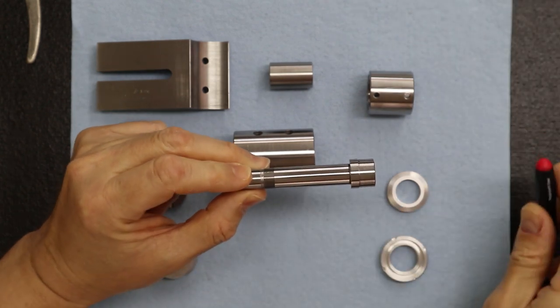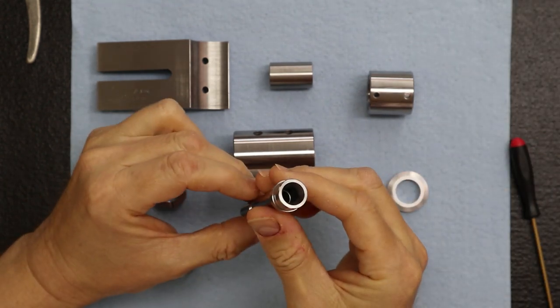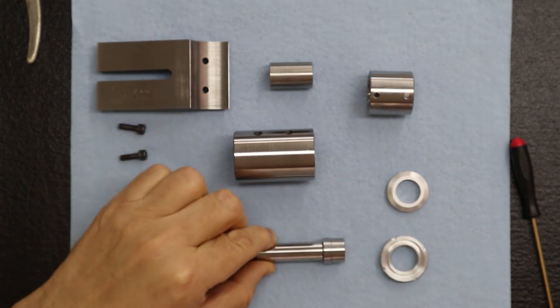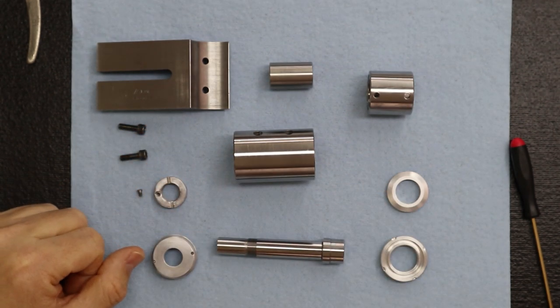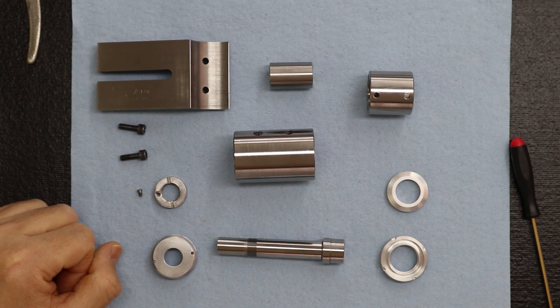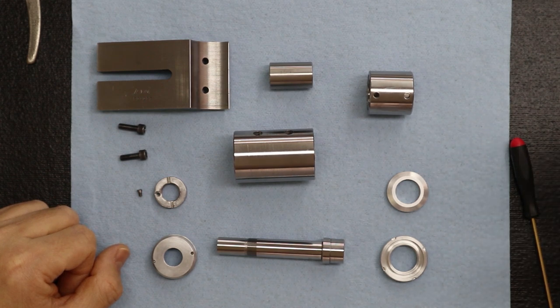I'm convinced. And the only reason we were having to rebuild this is it did what spindles do if you don't use them. It turned to a rock. Even those bearings aren't worn out, they're just done. Even though it looked like this has never been used, the bearings were still beyond repairable or use. Cleaning everything, we don't do that kind of thing around here. Not with this precision.